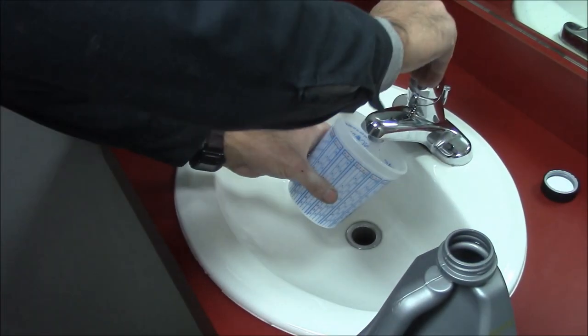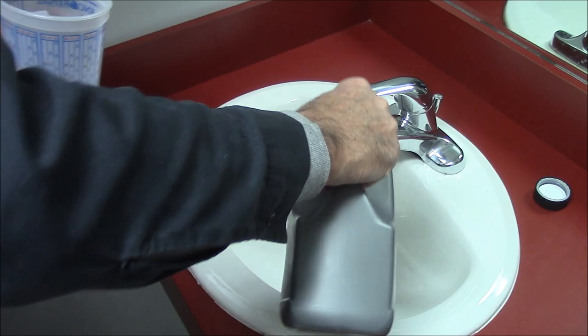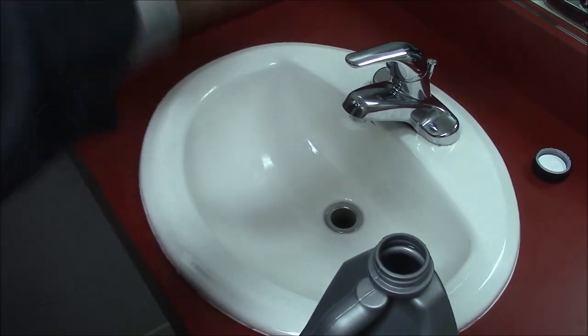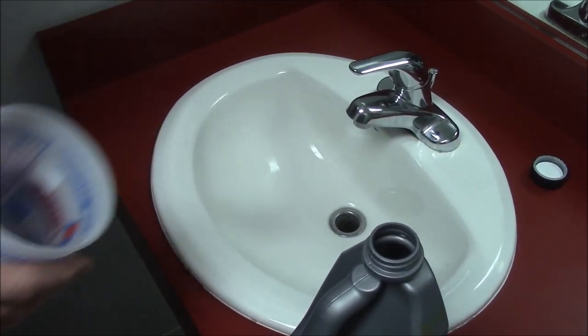So what I do is I do it again. So I do several small doses with chasers. Each chaser pushes it out of the trap. So we're taking a dilute mixture and we're loading up that wall with a dilute mixture of drain cleaners. Now we let it set their typical 15 minutes. We flush with plenty of water. Bingo. Drain's opened up. Life is running good.